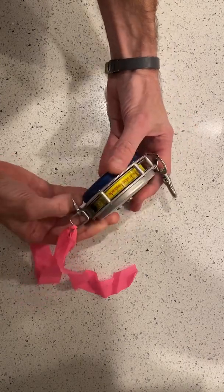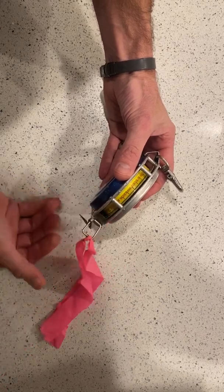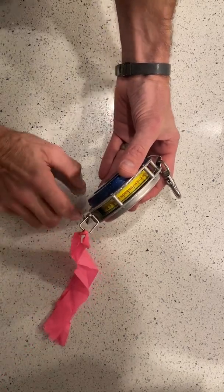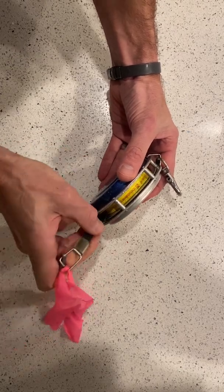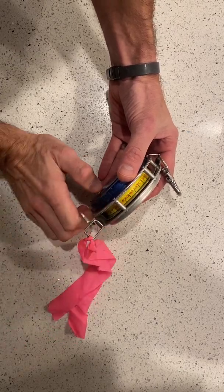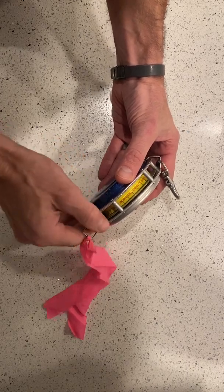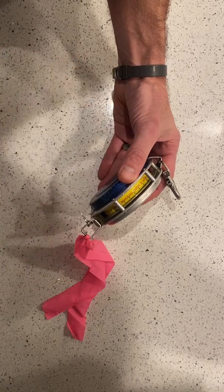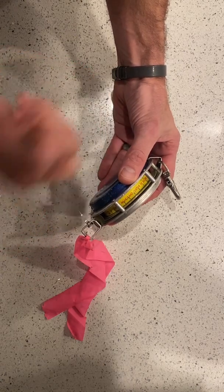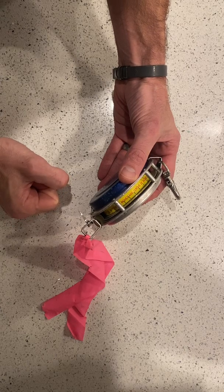You all have a 75 foot, so when you stretch this all the way out, it's going to go out to a total of 75 feet. It's important to know that because it is a steel tape — as you're approaching 75 feet, you want to slow down walking. That way you don't walk the end of the tape off and strip the tape out and break the end off, and that's never good.